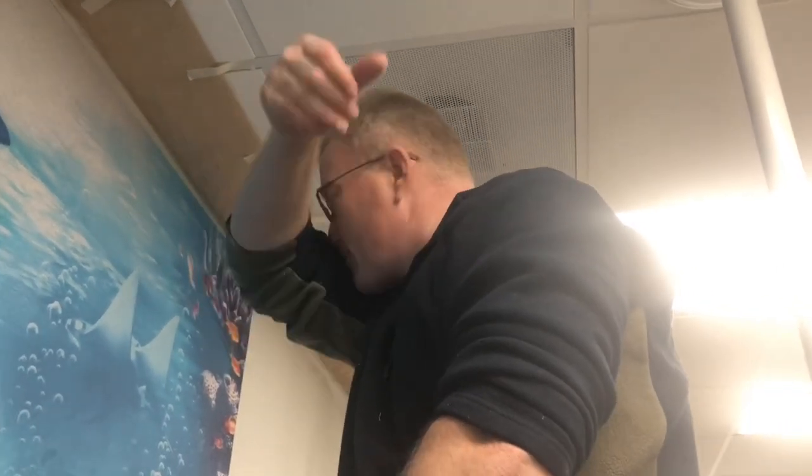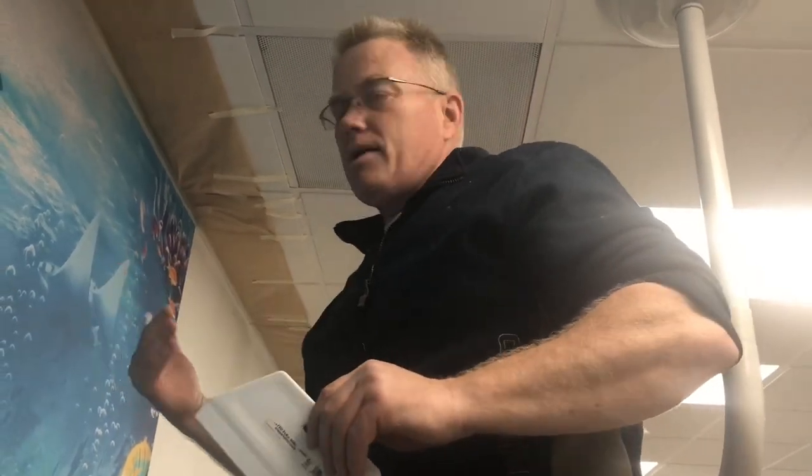And that is how you do a double cut. I know it looks easy, but it takes a long time to learn how much pressure you have to put according to the materials you have. If you have a very thin material and you push too hard, you're cutting through the wall, and now you have a draft, literally a draft behind your seam. That seam isn't gonna last. If you cut too little, you won't penetrate your undercut, and that's a disaster. This is just right.